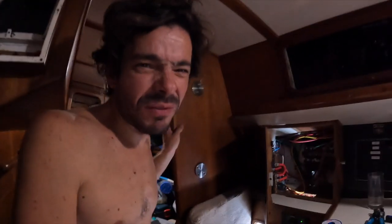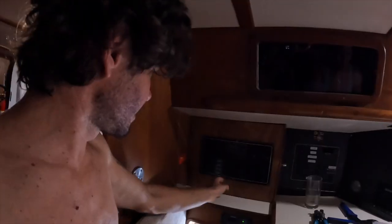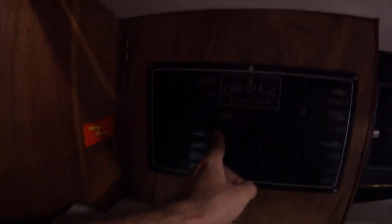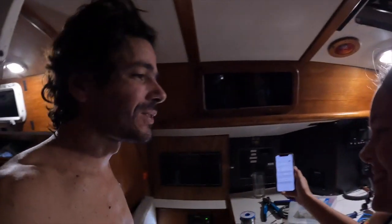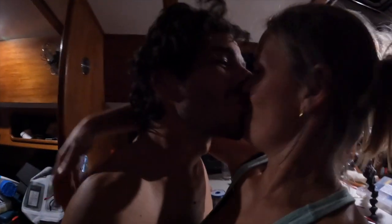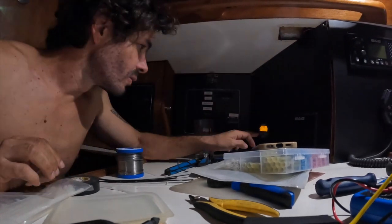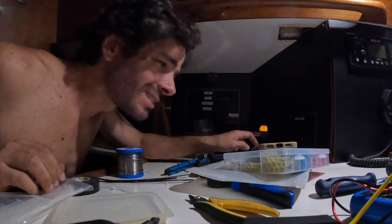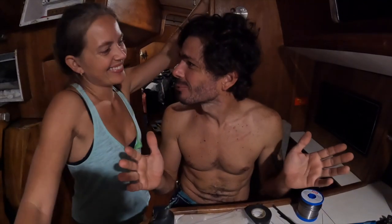After what was supposed to be 15 minutes but turned into about 3 hours, at least now it's really tight. All we need to do to start the internet is just flip it on. We have 12 volt internet now — that's so good. Right now we're using a steady 1.4 amps, and with the internet on we go to 1.6 amps — that means only 0.2 amps for the internet. The internet is going to be on 24/7 now.